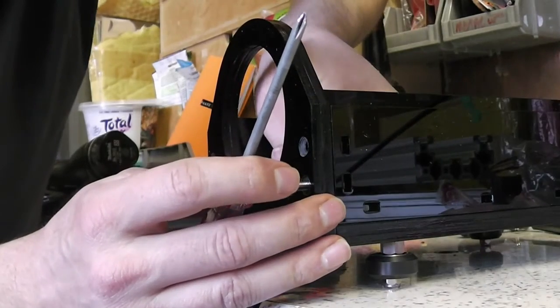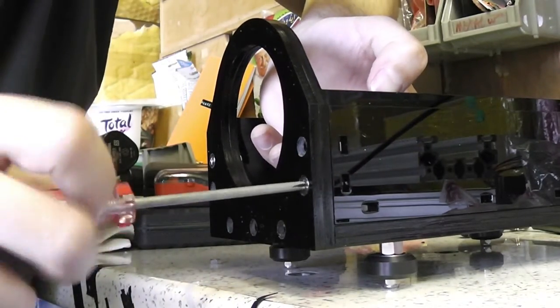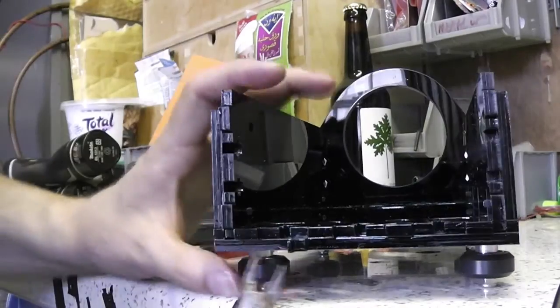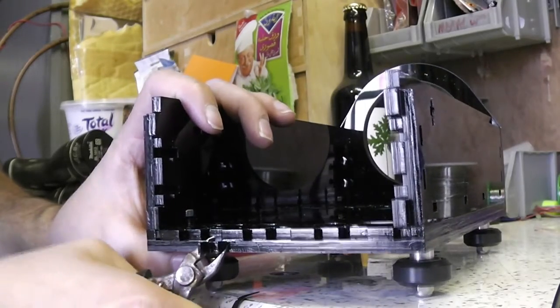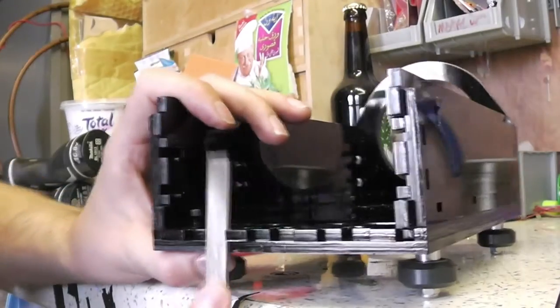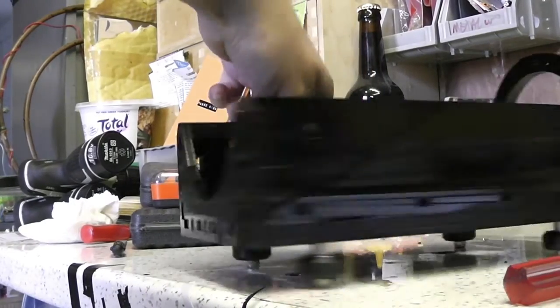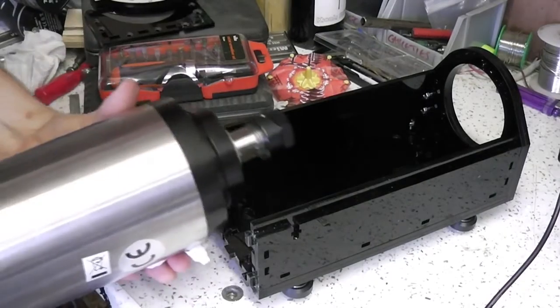When this is mounted vertically on the Z axis, that plate will be at the bottom — that is the plate with the hole in it — and the spindle will pass through that hole. That thing I'm cutting off now would have been the end stop flag, but I glued and countersunk the other parts wrong so that flag won't fit through the gap it was supposed to. I just filed it flat and now that part fits on like it should.